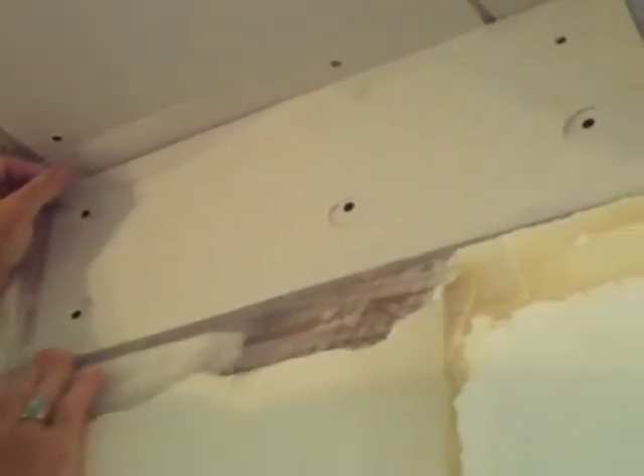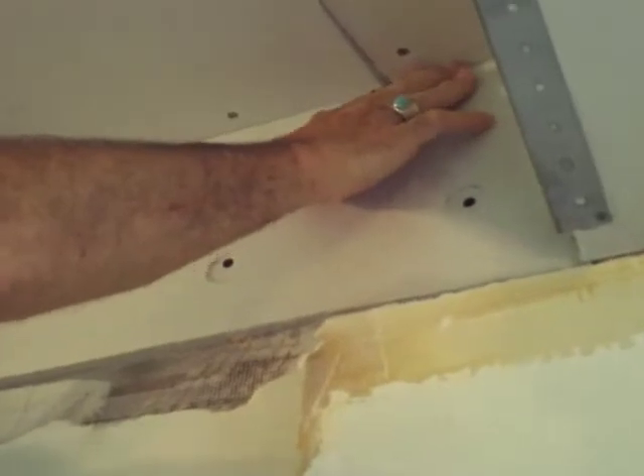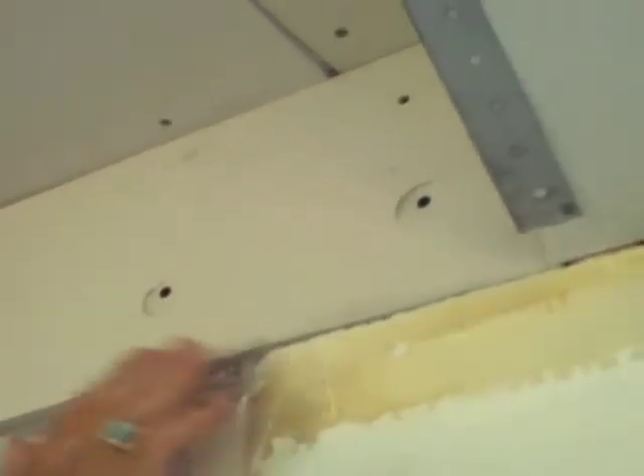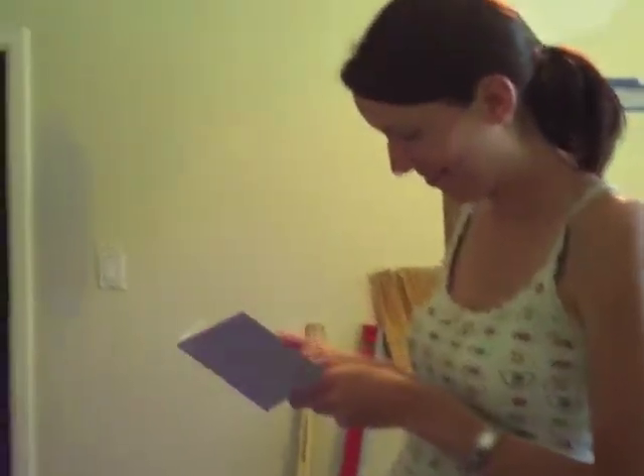What we've got here is this big hole covered. I just want to show you how we do the corner — you get the tape up in there and split it half on the ceiling and half on the wall, and you just put the tape in like that. We've got tape here, here, here, and that's how you do it. Now we've got it all taped and we're ready for the mud application. Shonda's just studying a tool here — a drywall tool, that is.